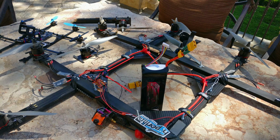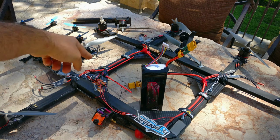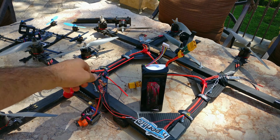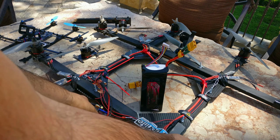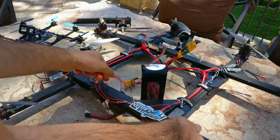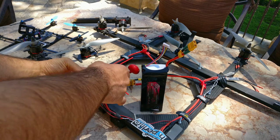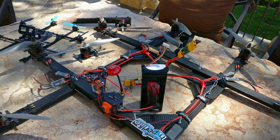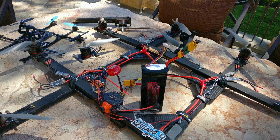On this one I'm taking a couple more precautions, and I was actually using a secondary power source for powering the flight controller, the VTX, and the camera system because I didn't want to deal with any kind of noise issues or vibrational issues at all. So I just took all that out of the equation and used a separate power source, which worked out fine. And I did test it before on much smaller props. They were like 8 or 9 inch props that I had lying around, and it couldn't generate enough power to take off. But it was working fine.